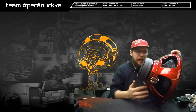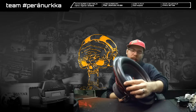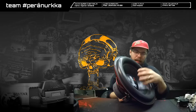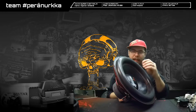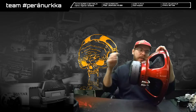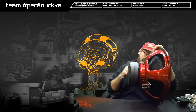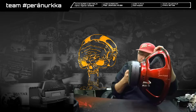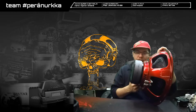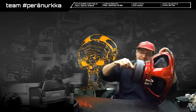Now the spider landing here is not that wide for the top surround here. So I think the spider in the subwoofer is meant to handle the excursion. It is the one that stops the movement on the biggest excursion, because the top surround can easily be really, really big in big excursion. But the 3-inch voice coil in here, which is a round copper voice coil, and the small spiders down in here will be affecting the Xmax or the Xmech more like.